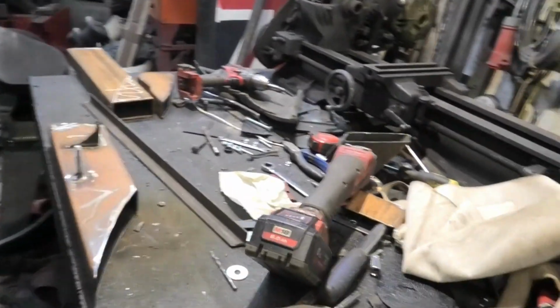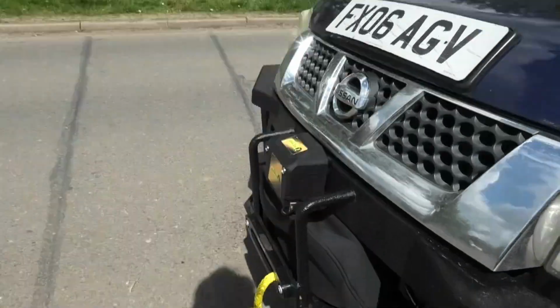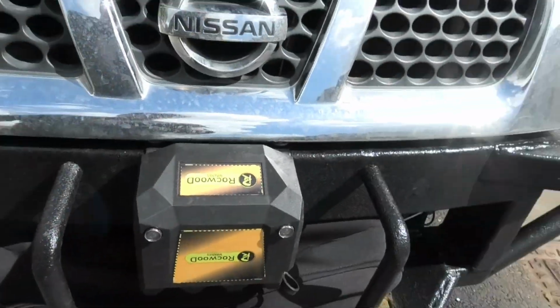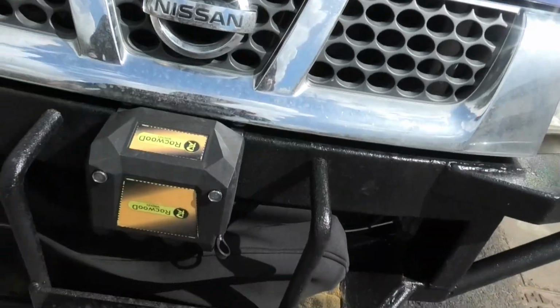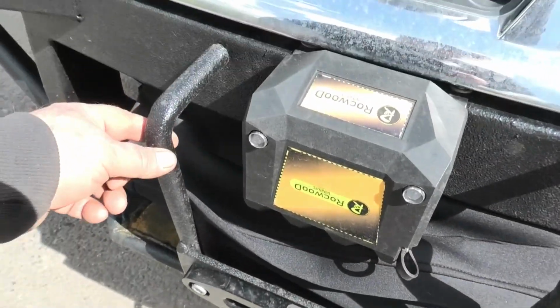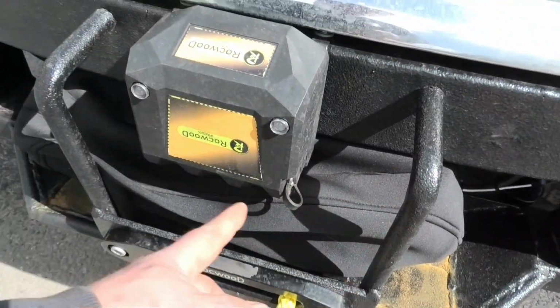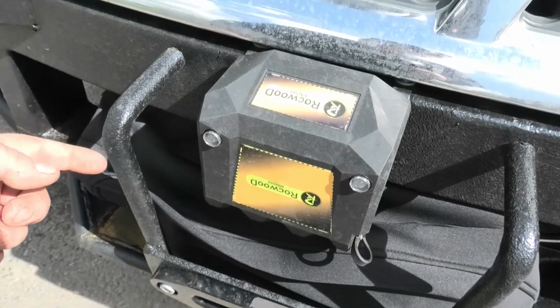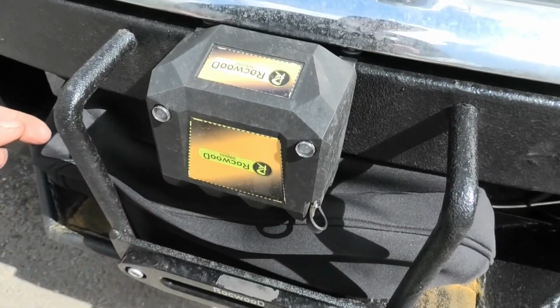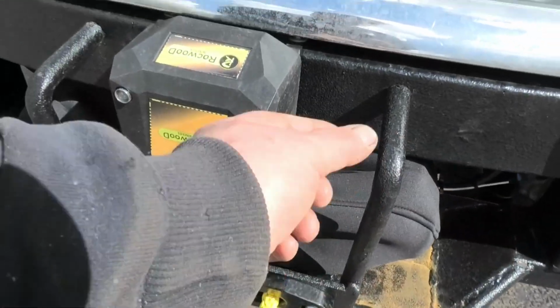Oh, the light bar as well. We've got to make a light bar to go on the front. Let me show you what I'm talking about. In my head it worked perfectly, but now I'm looking at this, I'm thinking I want to run 2 P-clips each side coming out so they can flip out there, and then I'm going to get a bar to go across with nuts welded inside, and then I can bolt that way and bolt that way with 2 brackets.